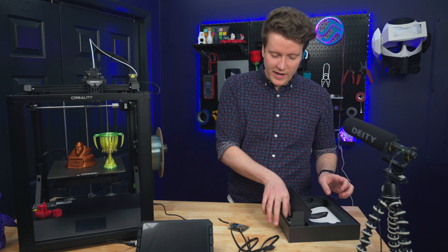The next step is getting the firmware loaded onto your 3D printer. You've got two options depending on which type of printer you have. This is the Ender 5 S1, and for this one you can just use the USB connection, which was super easy. You get everything set up, turn the printer off, turn it back on, and you know the firmware is flashed because the screen on the front doesn't turn on — it just stays black. That's going to happen on most 3D printers once you install Klipper, since the microcontroller is just talking to your computer now. It took maybe 30 minutes, and a lot of that time was me walking away while it was flashing firmware or doing some other step.